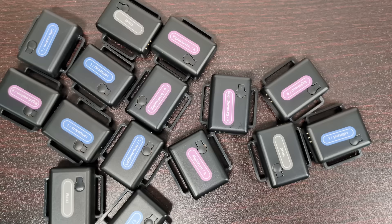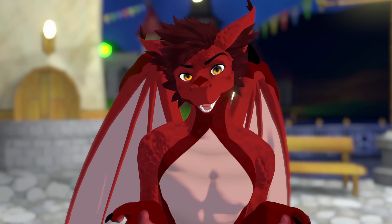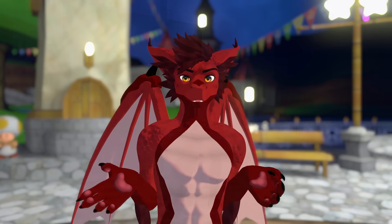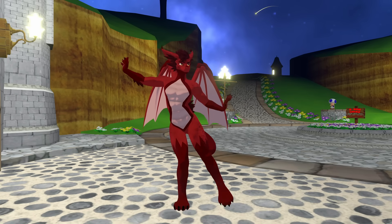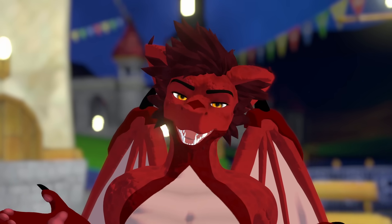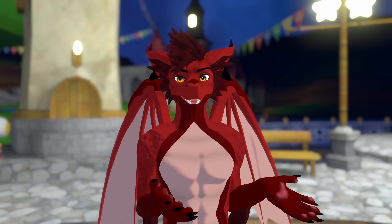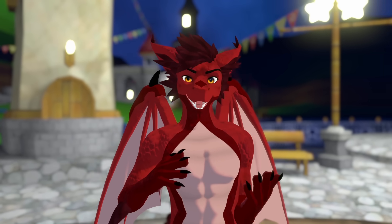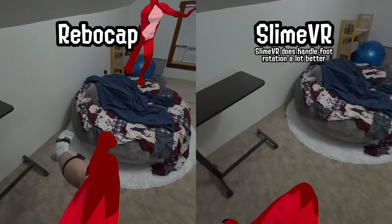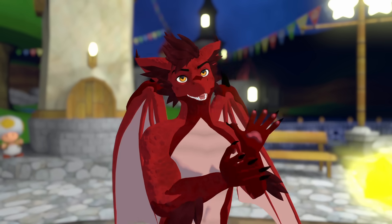How well do the trackers perform though? One thing to note is that you can only use 12 at a time for VR — though that's kind of overkill since most social VR games only support 11-point tracking, and three of those points are your headset and controllers. One of the first things I check with IMU trackers is how floaty they look. SlimeVR set up well won't look floaty, and ReboCap doesn't either. Certain settings like follow mode can cause ReboCap to look floaty, so bear that in mind. As for accuracy, ReboCap is actually comparable to SlimeVR.